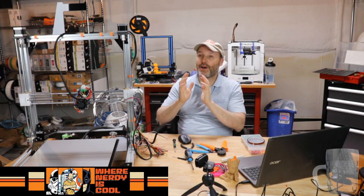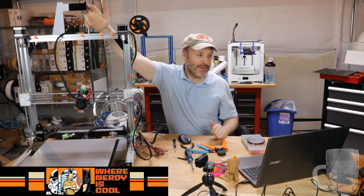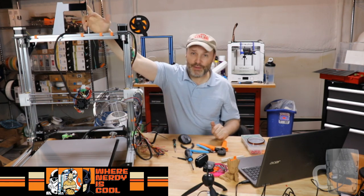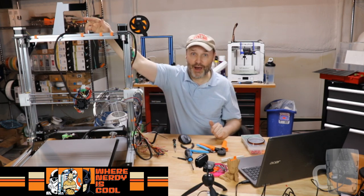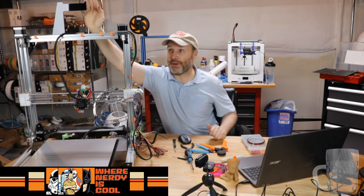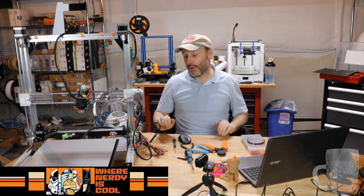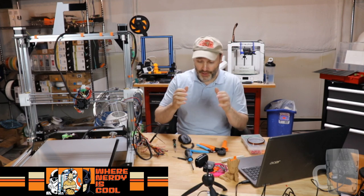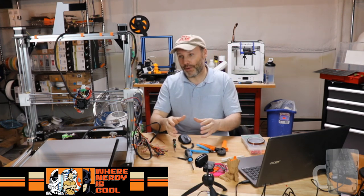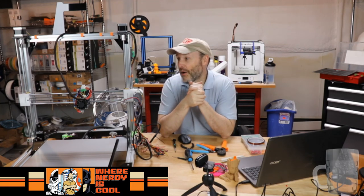So a lot of upgrades I want to make to the FT5. I also want to make some changes to the filament. I'm not a fan of filaments being mounted up high. I prefer them to be off to the side, because you have a printer that's moving and swaying, and the last thing you want to do is add weight to the top of it, so that when it moves and sways, it now has a big weight up top and can sway some more. Don't want that. And again, I'm not a physics guru. I'm just going from what I've observed watching my CR10 and TEVOs do that. I definitely prefer to have the filament on the side, sitting on a couple of ball bearings, or the 608ZZ skateboard bearings, and that works really slick.